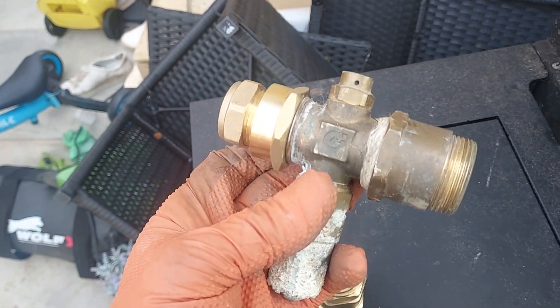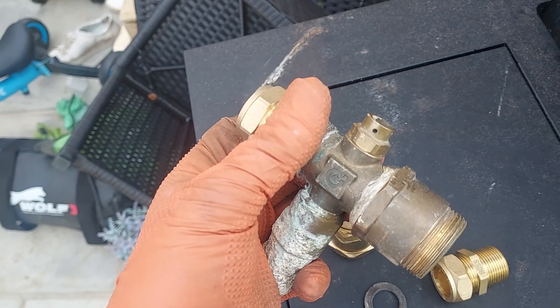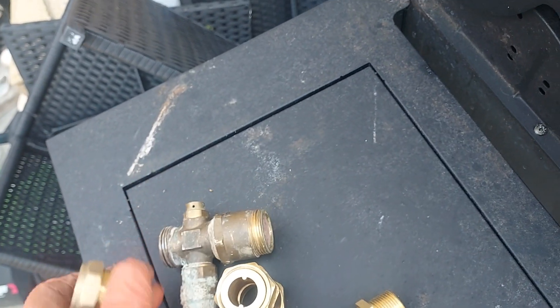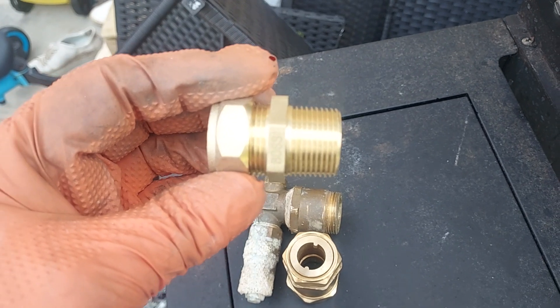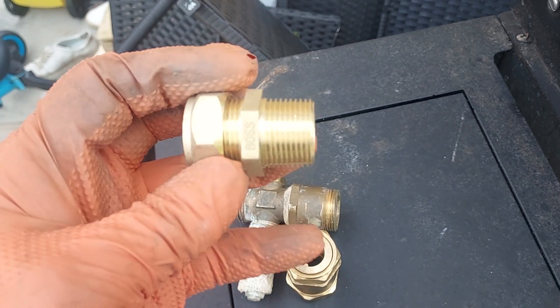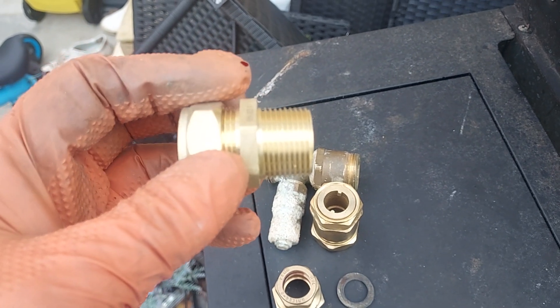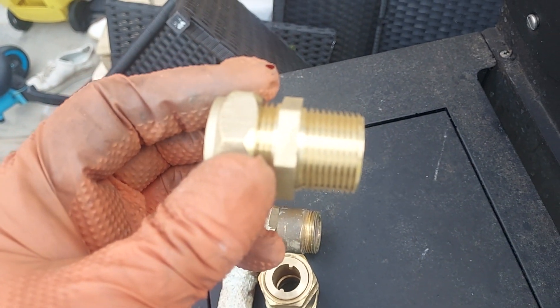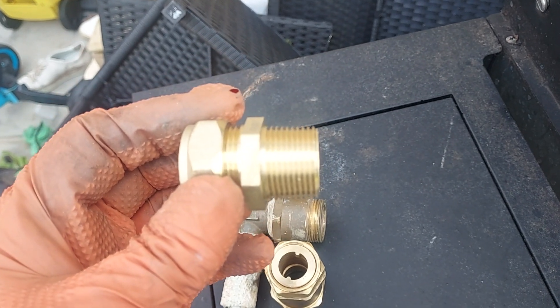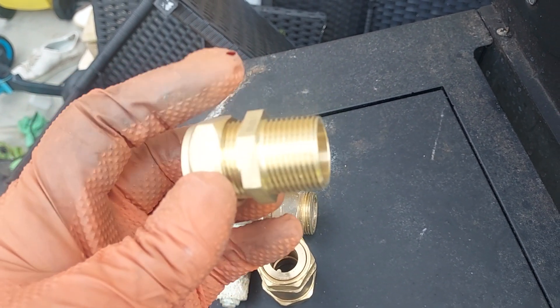There's no way that'll tighten up onto that thread — that is for a taper thread. To demonstrate, I've got this fitting with a super exaggerated taper on it. The idea is as you drive it in with your PTFE tape, paste, Loctite tape, Rapid Blue, or Loctite, it will start to nip up and tighten up in the female thread, giving you a very snug watertight joint.